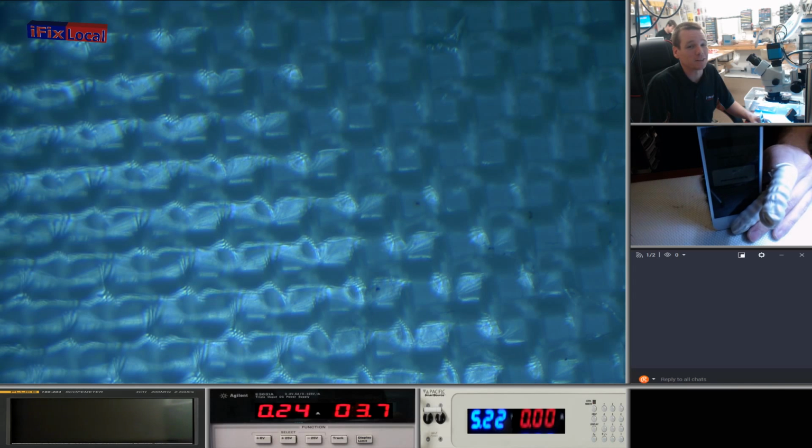Because if this person hadn't stuck their phone in rice, the likelihood is that they would have dried it out. We could have cleaned all the salts and stuff off the board, and it wouldn't be in the condition it's in. The fact it's got all of those burns across the board, that's power that's gone in. That's not the battery that's caused that. Someone's connected power to a DC outlet, which is basically the wall plug that you plug the power into at the bottom, and that sent 5 volts straight through the board to places it shouldn't be going, to caps and stuff that aren't rated to handle that, and that's why you've got these burn marks all over the board. But yeah, we're going to leave it there, and I'll catch you later.